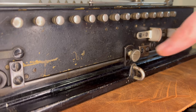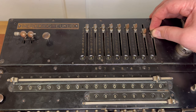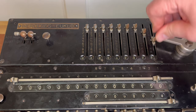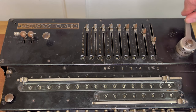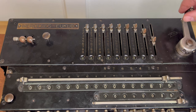That's a pre-Kensington lock attachment point. So if I want to multiply 25 by itself, the first thing I do is put in the locking pin. I'll enter 25 into the sliders and then I'll spin it five times. Then I'll carefully shift it one space using that little carriage knob and spin it two more times. And if I happen to accidentally spin it three times, good thing there's that pin in there to lock down those levers — and I'll just subtract it.